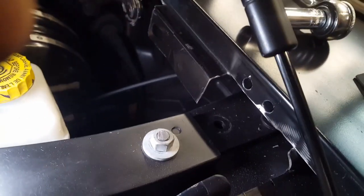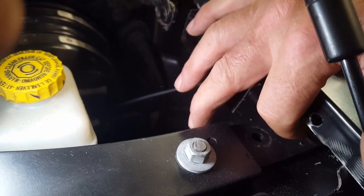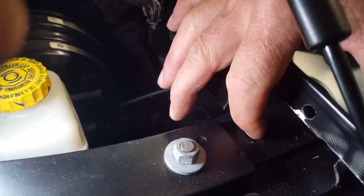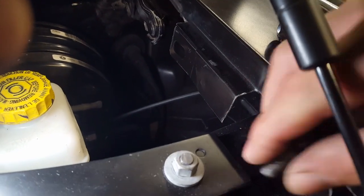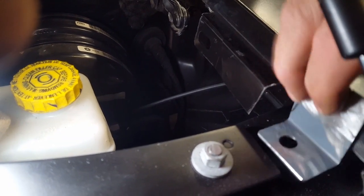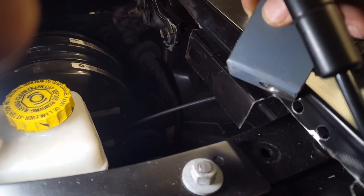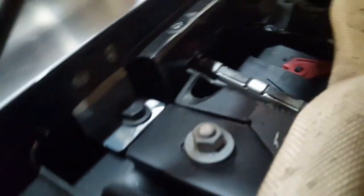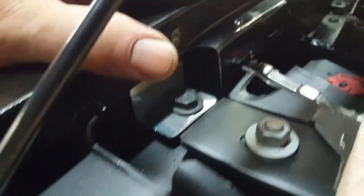For the back of the fender on the top side, there are two bolts that used to hold this on. I put a plate here and then a stud. For the forward locating point, I cut out this metal on the fender and it exposed this bolt-up point right here — a nice strong spot. The bracket is made out of 14 gauge and slides up underneath the fender, bolts down, and I plug weld it through. On this side it's already in place, plug welded through the top of the fender and bolted down — a solid connection.